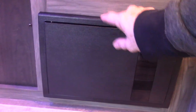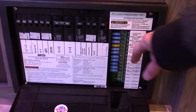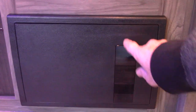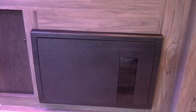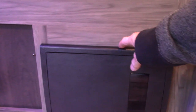This device down here is the power converter — it converts 110 AC to 12-volt DC. On the AC side it has regular 110-volt AC circuit breakers just like you'd have at home, and they're all labeled. The power is converted to 12-volt DC on this side with labeled fuses. If any fuse blows, there's an LED in there that lights up — you can see it glowing through the tinted plastic just by walking by. Also, when you're plugged into shore power, this acts as a battery tender — it senses how much energy your battery has and keeps it charged, sending up to 10 amps if it's low or just a trickle to top it off.